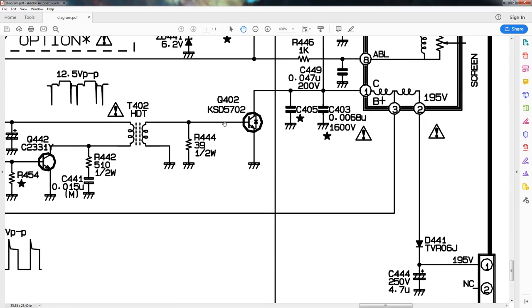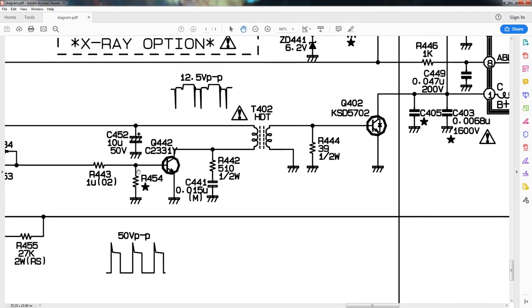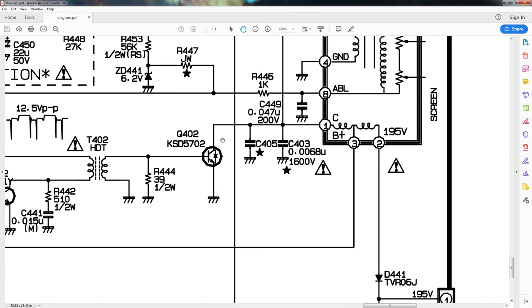And this transistor is actually being switched by this isolation transformer. Now, this isolation transformer is actually being driven by, you guessed it, another switch, right? But this one is easier to drive. It's smaller. It's like a jelly bean transistor. The transistor that is actually driving our flyback is over here, on the other side of the isolation transformer. It's much beefier, and it's harder to drive.